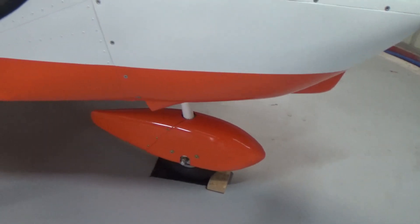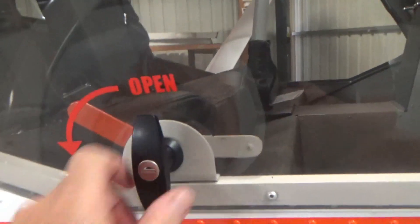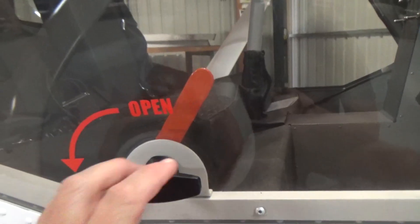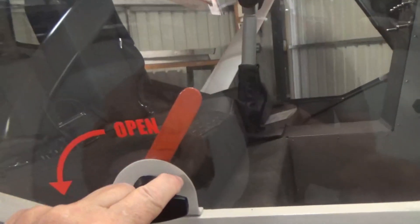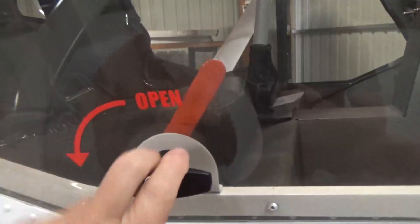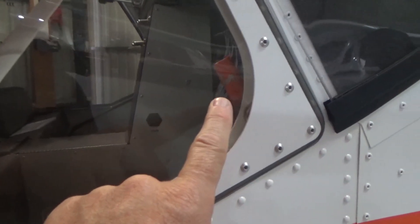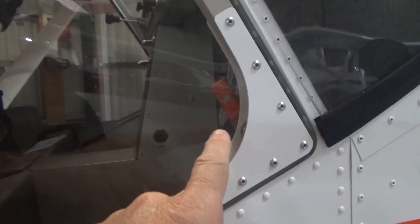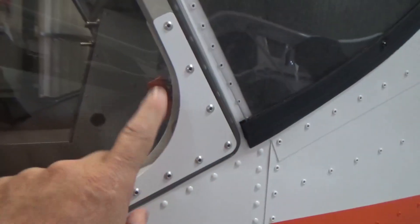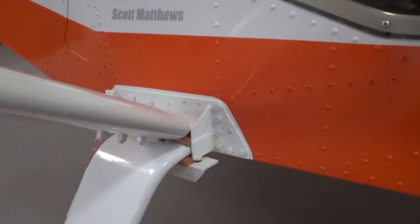Wheel spats holding up pretty good. The doors — I've got my little open and close mechanism there. The way I've got mine set up, this side seems okay, because in flight if you push that forward it's locking for the passenger. If they do freak out and grab something, they could potentially unlock the door. But you can't plan for every scenario, and there is the forward lock in there. This one does become a bit of a pain — you forever hop out the other side and this one's locked, so you've got to climb back in. Just got to get into the habit of unlocking this door so you can get in this side to do whatever you have to do.